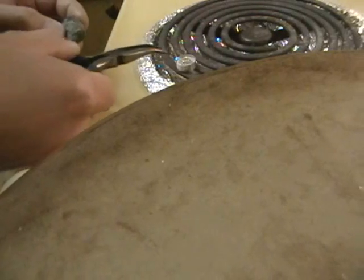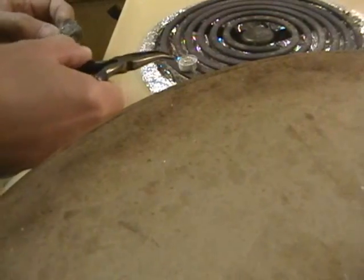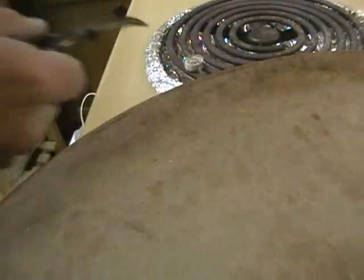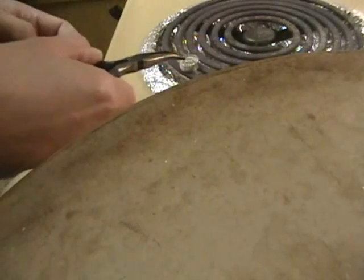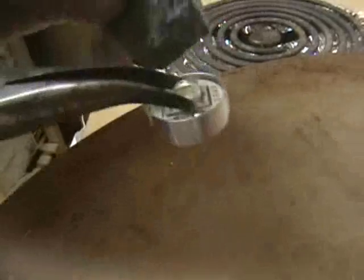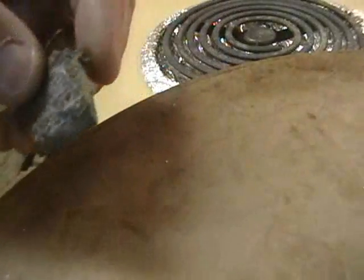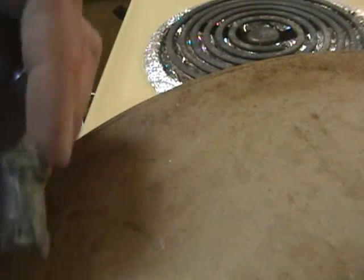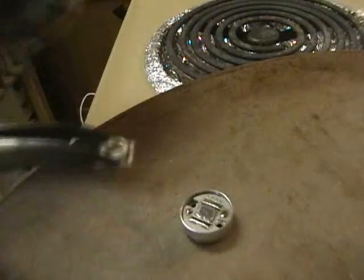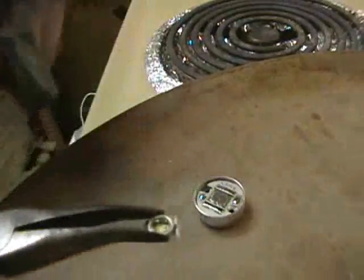It's starting to smoke a little bit — now a lot. The solder is now flowing and I can pick up my LED. I used my rock to bump off the heat sink — the heat sink is still hot, I don't want to touch that. I bumped the rock against the heat sink and it just falls right down.